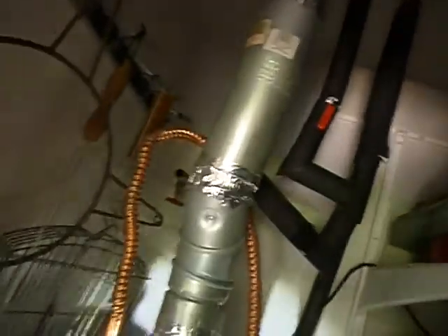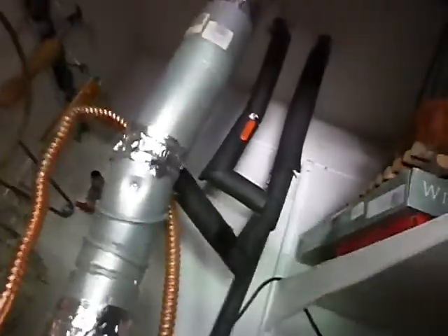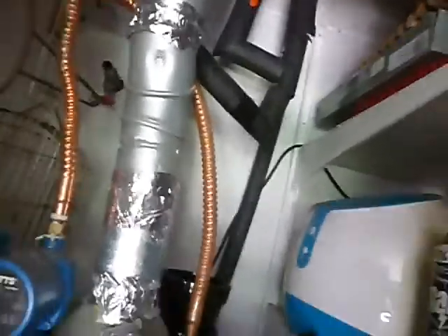That screen no longer meets current requirements. This flue does not have a thimble on it, and flues are supposed to fit together — they're supposed to get along. They're not supposed to be taped up. Wrong tape.